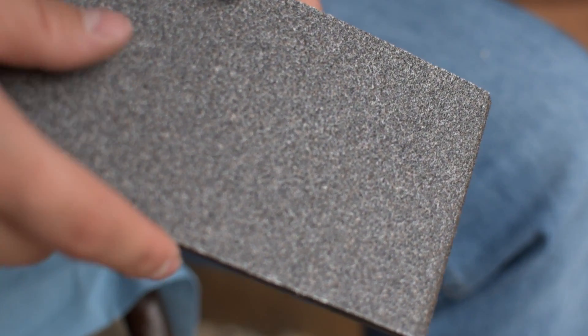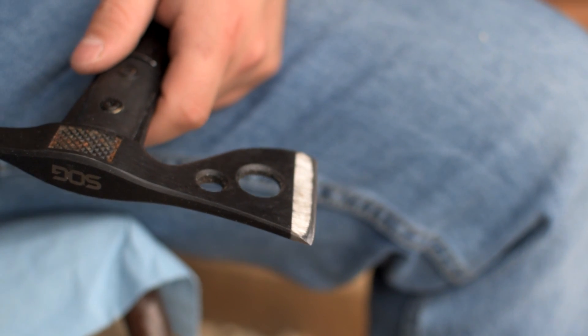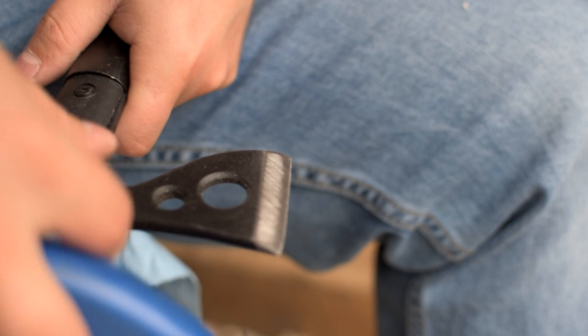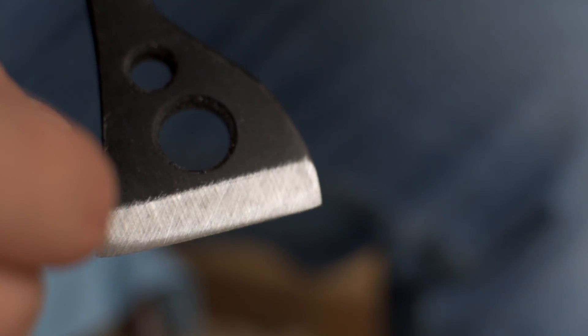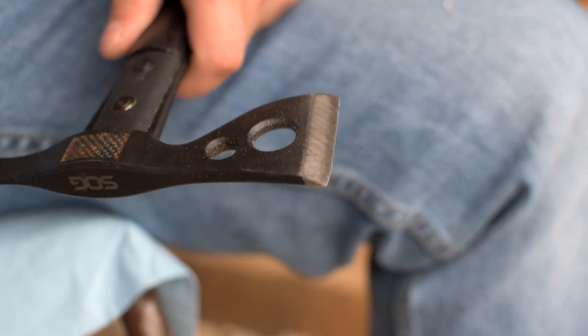Now, you may not have thought about doing high-end refined sharpening with sandpaper, but let me tell you, it's cheap and it works like magic. Now I'm starting pretty coarse — this is 60 grit here today. If you're just trying this method for the first time, I wouldn't recommend going this low, because it cuts quite quickly. It's already starting to cut away at that bit. Maybe start with 100 grit paper. I'm starting with 60 grit just to speed up the process a little bit, and I've had lots of practice.